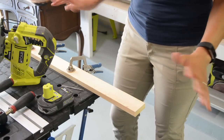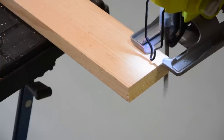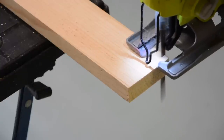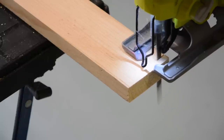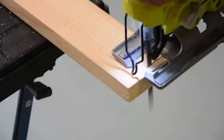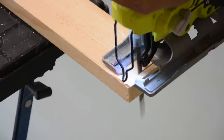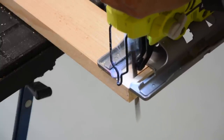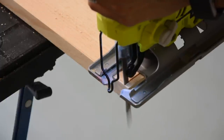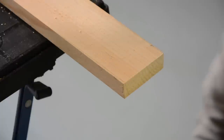We are finally ready for our first cut. The jigsaw is an orbital jigsaw — most basic saws have blades that go straight up and down, which is good for metal and scrolling. But with an orbital jigsaw, the blade goes slightly forward and back, allowing for faster cuts in softer materials and helping remove chips from the blade path. The orbital action is adjusted with the knob on the front. Also important: jigsaws are best on thin materials. With thicker material you may get drift — where the top cut is accurate but the bottom is crooked. To prevent this, use good quality blades and keep the base flat.